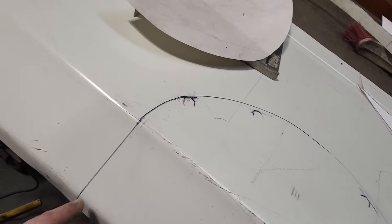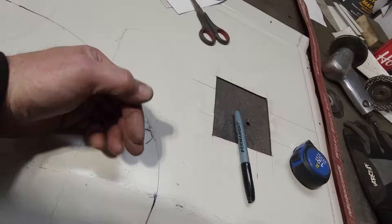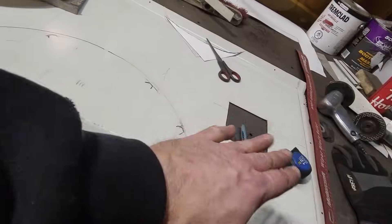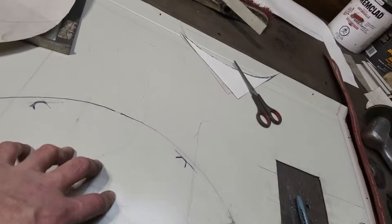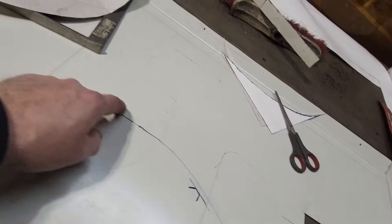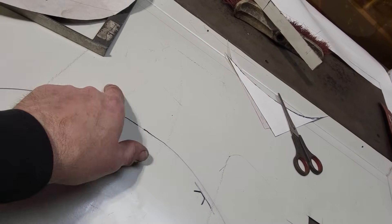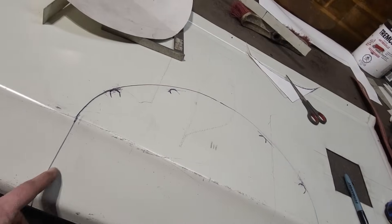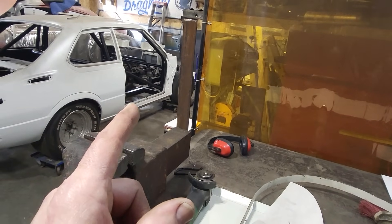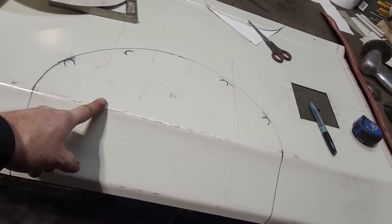On both sides, and I'm just going to cut that straight off there. All I'm going to do here is trim this off. Some people say roll it over on the edge and dolly it — no, I'm not going to like that. I don't want to disturb none of this here. I'm going to fit it in the car and make sure everything's all right. I'm possibly going to put some beads in it up here somewhere along here, just use the bead roller and do a couple of small beads. Usually the top side here is the flimsiest, and a lot of the GMs just have a crinkle going up through here. I kind of like that look. But all I'm going to do here now is trim this off, cut this piece out altogether, go over and get the transmission mounted in the car, get that set up with the mid plate and everything, and test fit this back in the car to see how close we are.